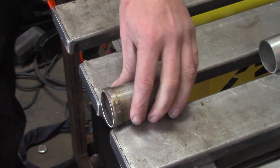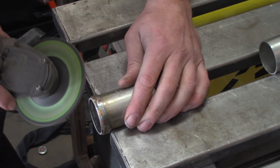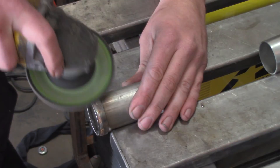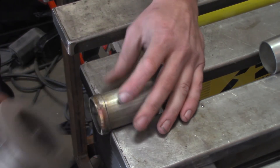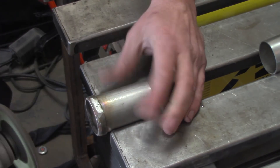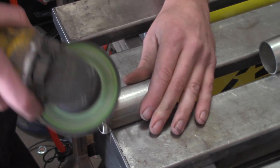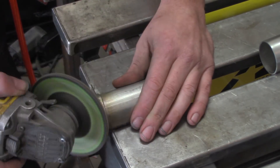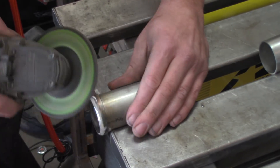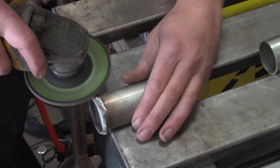Now, all of these need to be shaped and set accordingly to actually put a taper on it, because we're essentially making a cone. And to do that, we need to make sure that it's going to seal into the gasket properly. First, we're going to take down that little weave that we just laid down there — as pretty as it was — we're going to get rid of it, and then we're going to face it off. Facing off is to make sure it's nice and even, and then we'll go over it nice and easy, let the flap disc do all the work — not your muscles — and we'll taper this end into a cone and get it all nice and straightened out.